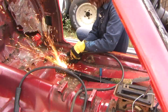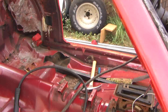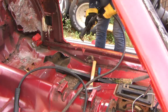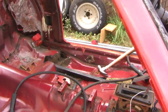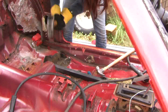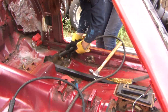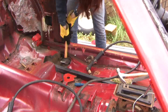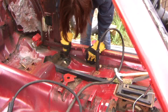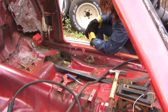I did the same to the other side, and now I'm doing some more exploring and cutting through the floorboard. There's the leaf spring bracket — it's kind of a bulged, thicker piece of metal. I'm trying to smash that bracket down a little bit, and I finally gave up and started cutting a hole through it so I could put a diagonal brace that's going to go out to the roll cage.